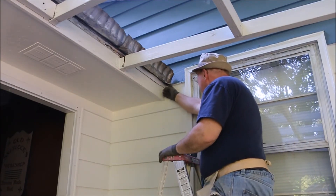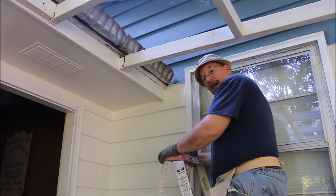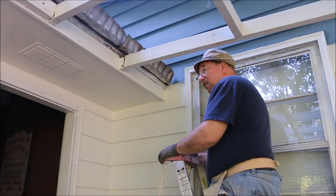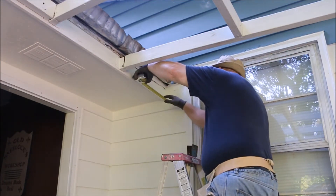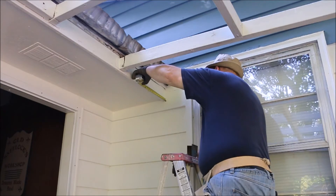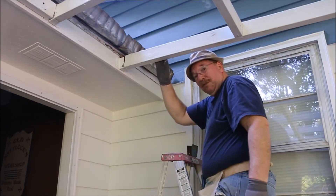Now this is where the roof line meets the house. I had to put a piece of flashing in here and close that up because the water running down that spot had actually softened it to the point where bugs had eaten the wall. Bugs like having a damp area — it makes things easier to eat and keeps them happy. Now I expect to come over about 8 inches, and I think that should be enough. I don't want to go too far because I need the spot where the water runs down the roof — I want to redirect that water over onto this section of the roof so that it goes down to the gutter.